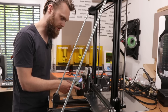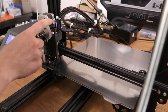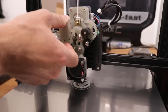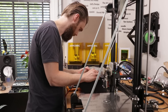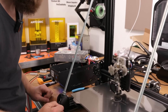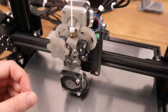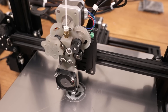I'm going to print one of these gears quickly out of cheap PLA to see if everything is set up correctly. It's actually running quite well, but you can hear that it's sometimes skipping steps - that's the motor. I have to increase the motor current in order for this thing to print reliably. I've increased the stepper motor current a bit, so hopefully it doesn't skip. The driver is still not blowing up fortunately. I think this thing is running smoothly - retraction torture test. I'm going to let this finish and then we are going to print flexible filaments, starting with the least flexible and working our way up.